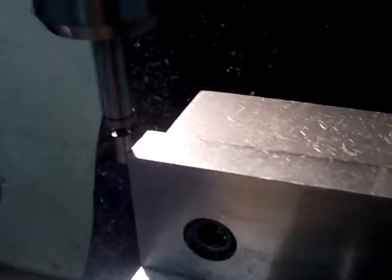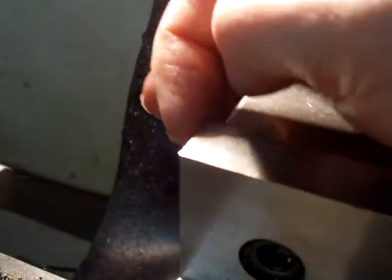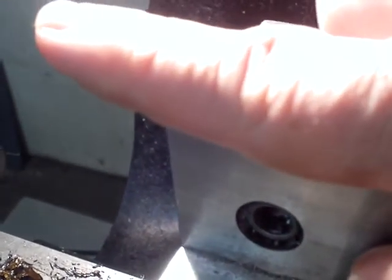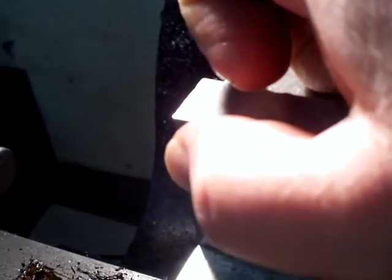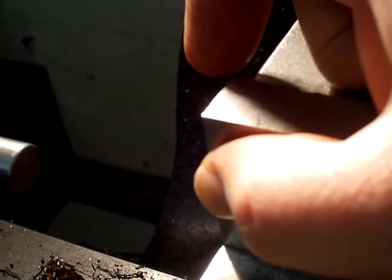We go back here to the hand wheel, and amazingly it's right on zero. So that confirms what our first test was. Now what we can do is raise the spindle up and turn it off. Right now the center of the spindle rotation is 100 thousandths away from this surface. So we need to go that way with the table 100 thousandths, and then we'll have zero on x. And we have to come back 125 thousandths to get zero, zero on y. So we're going to go 100 thousandths in x, 125 on y, and we'll be at zero, zero, and we can set up the next part and know where we are when we drill the first hole.